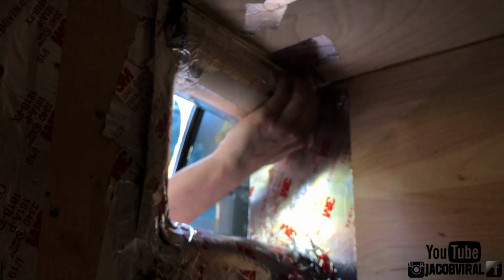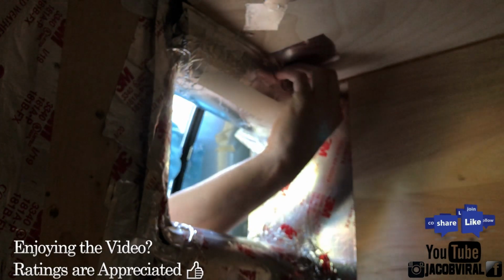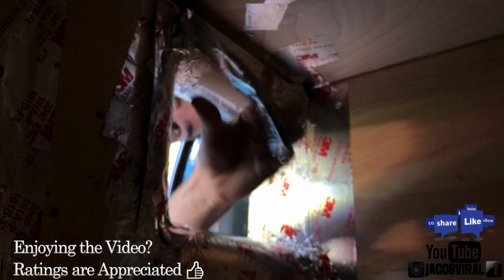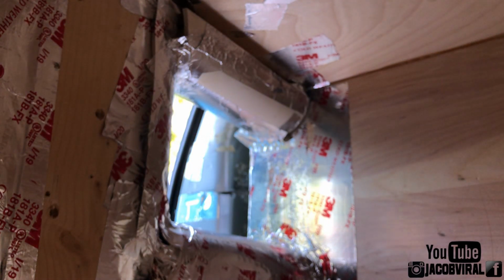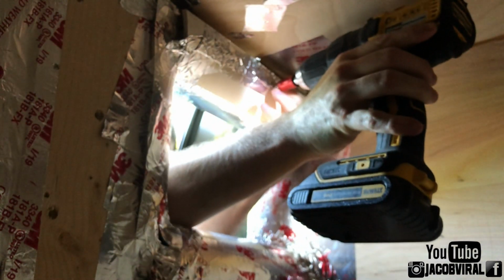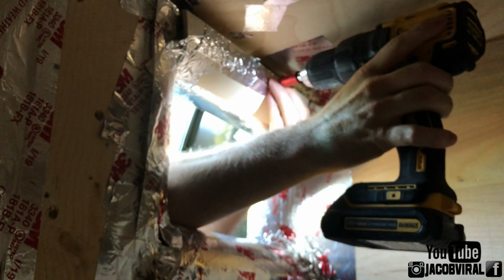This is the one that's really tricky because you have to identify where your screws are in a tight spot. Smaller ports are a little harder to see than the big ports for this. Usually the more cone area you have in the system, the bigger your port. Those fourth orders are normally around, I would say, the 40 to 50% cone area range. But bandpass enclosures are usually a little bit more, just because of the way pressure builds up, and they're tuned higher. So you need more port area to be tuned higher, if that makes sense. All right, so what I'm trying to do is identify where I put the screws in here, and I'll just talk while I do it, I guess. I don't normally do this.